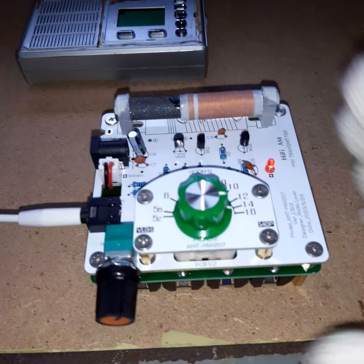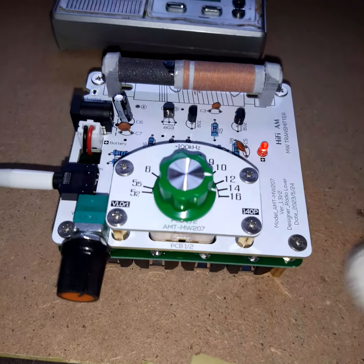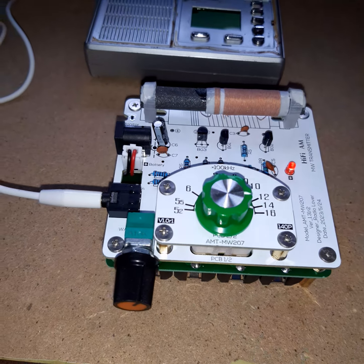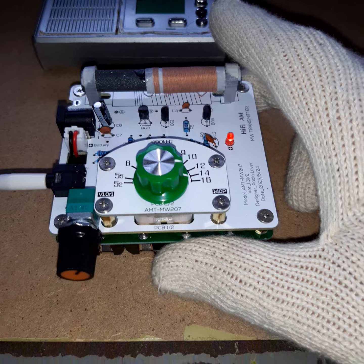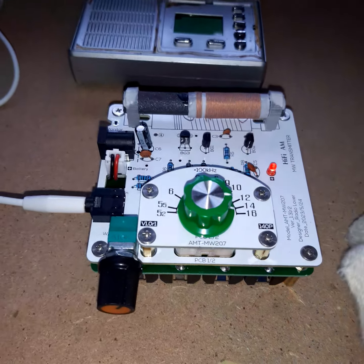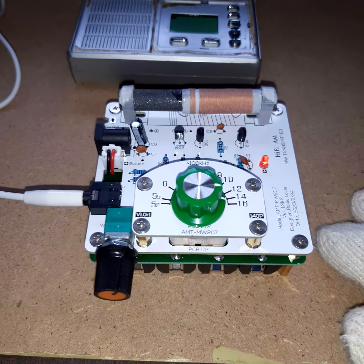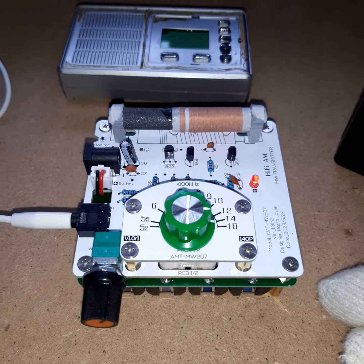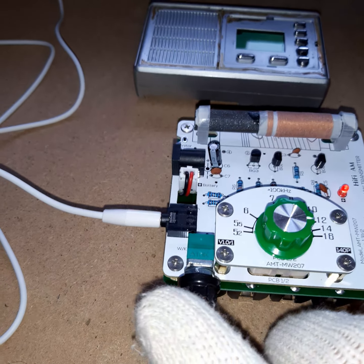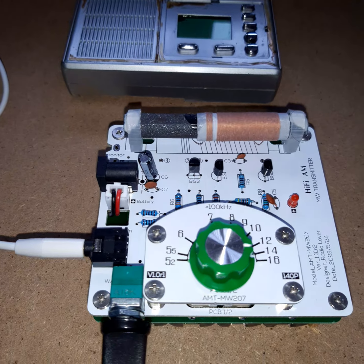So this is the review of this transmitter, dear Radio Lover, who has all the fame. I always wanted to have people making videos about my circuits, people in forums discussing the circuit — this is all I wanted to achieve. You make this thing and you get all the fame I want, and here is even a video from me. But as you see, I'm critical — I'm showing what this thing can do. Whoever wants to buy it, here is your decision: you can buy it. It does work on lower frequencies and produces a very good audio signal on lower frequencies. But don't try the higher frequencies. About power consumption: if you turn it off, the LED stays on for quite a while, so it just draws a few milliamps. It will probably run 30, 40, 50 hours with one battery pack — 50 hours runtime, I'm sure it will do.